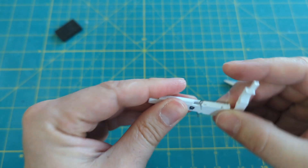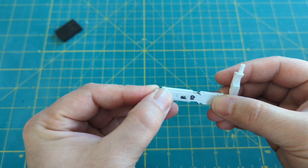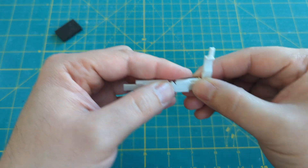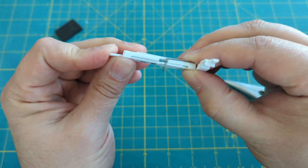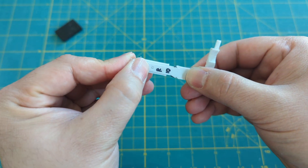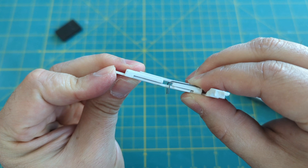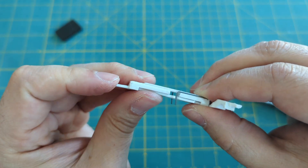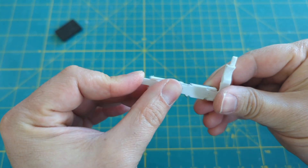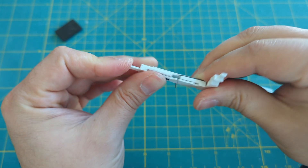Here's probably a better view of how those legs should be interacting. And that's it — this is a functioning carry lever spring. You may need to do this specific to each carry lever and bearing. You may notice that I have marked my carry levers and bearings so that I know which ones pair together — this is a good practice. I hope this helps and I hope you enjoy building your calculator.